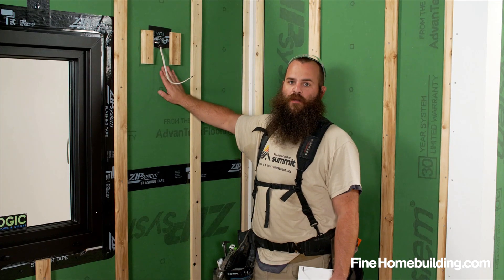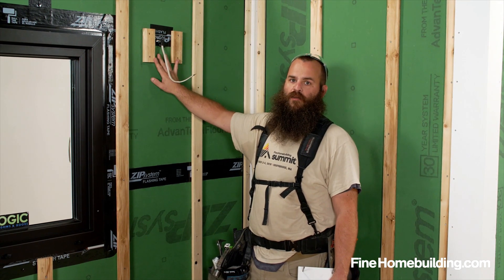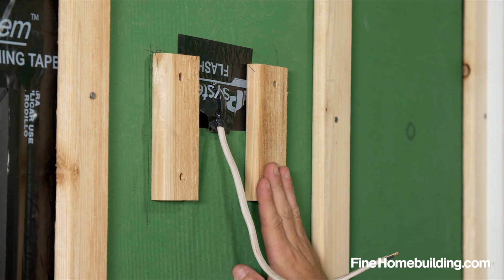In this case, with the wire coming out, we clearly have to pad out in order to bring the block out to the face of the siding. You can see I've simply added some pieces of 1x3 here in order to create that needed depth.